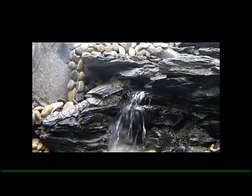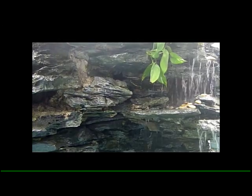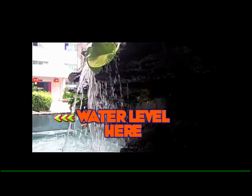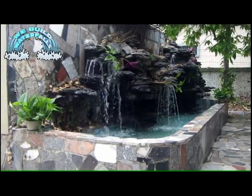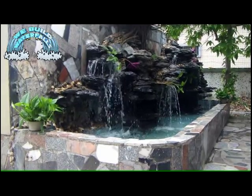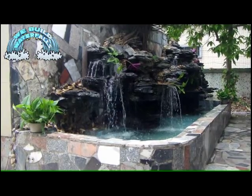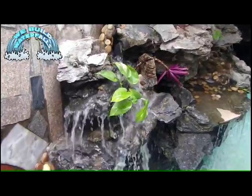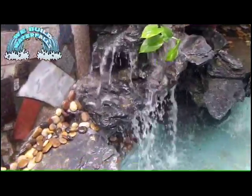See, we got everything running pretty good now. Water's pretty clean. So we'll run this for a couple days now and get rid of any mortar. Then we'll drain her all and maybe drain it twice, who knows. Give everything a good acid wash, make sure we get rid of the rest of these algae stains. We found a good clear waterproofing over here in China, so we'll do all the ceramic tiles a couple times, so we leave the appearance of that for the time being. Next year we're going to do all the floor and the walls in natural stone.